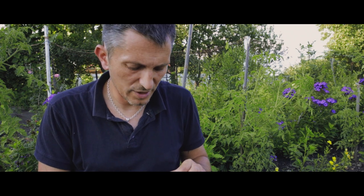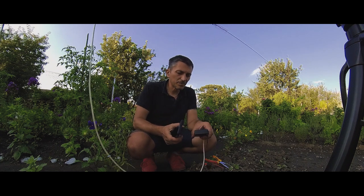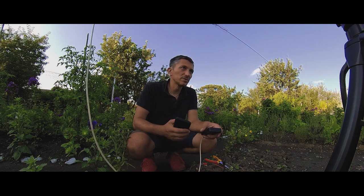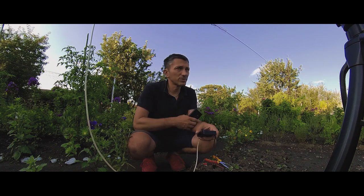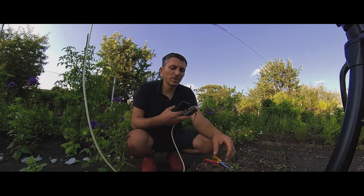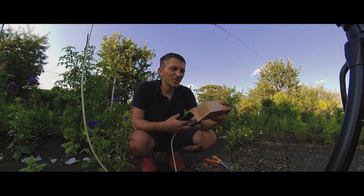Four bands out of the 49 to 1 transformer — which is not bad. I think maybe using a different kind of wire, maybe using traps or connectors to get the right bands, I could use a very simple 49 to 1 transformer, especially for portable work, so I don't have to carry this bulky ATU with me. But anyway, it's just an idea.